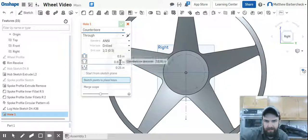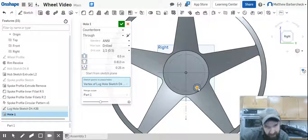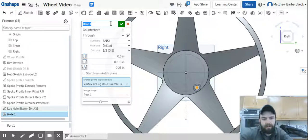0.5, and you want the counterbore distance to be 13/16, and the depth of that counterbore to be 0.25. These pictures are really helpful as far as showing you what's really going on here. Then it just asks you for, in this blue rectangle, the sketch points to place holes. So select that 5 o'clock point you created, and you'll end up with a counterbore hole. Should look like this. And then just name this lug hole